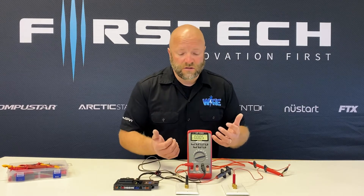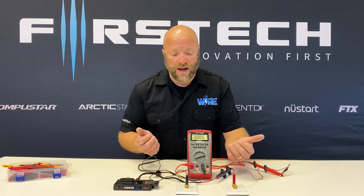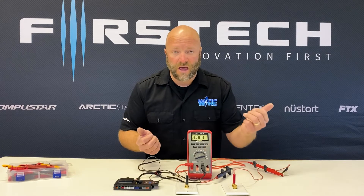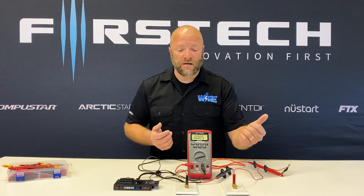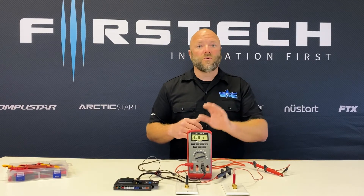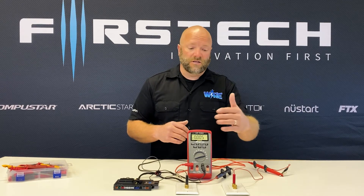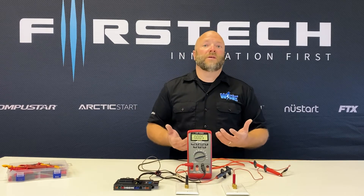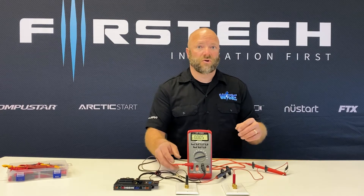When you do this, you'll need to set your meter: A is for amps, mA is for milliamps, and μA is for microamps. Typically you'll want to just set it for the amp setting. This meter, and all meters hopefully, are fused internally. This protects the circuit — if you draw too much power through the meter leads, it could melt them. They're typically limited to 10 amps of current draw.